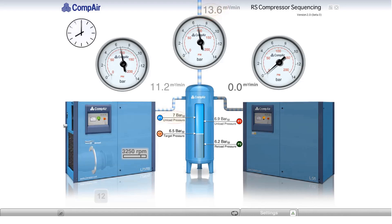As long as the plant air demand stays at or below 13.6 m³ per minute, the variable-speed machine matches the air demand, keeping the header pressure constant to within plus 0.07 bar of the target. Now it's approaching 10:30 a.m. and some heavy production begins. The air demand reaches 16.3 m³ per minute. The variable-speed machine can't keep up with the new demand, and the pressure falls.